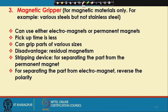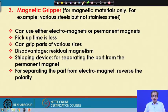We are discussing the working principles of different types of end effectors used in robots. I am going to start with the working principle of a magnetic gripper. This magnetic gripper is suitable for magnetic material. For example, if I consider a component made of steel, this particular magnetic gripper is going to work, but it will not work for stainless steel, because stainless steel is non-magnetic.